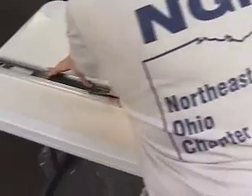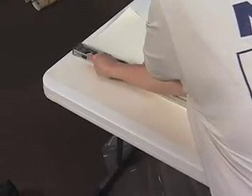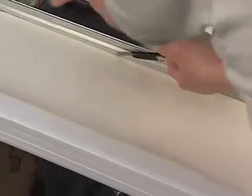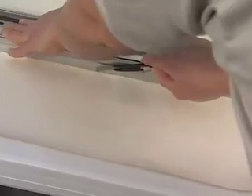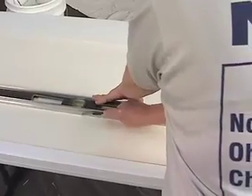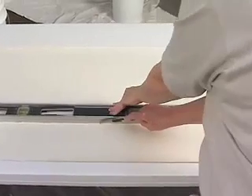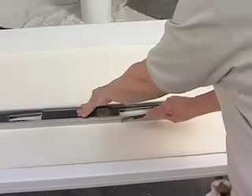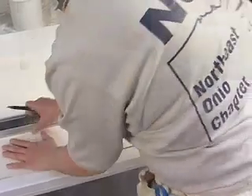Hold the level with your off hand. With a single edge razor or snap knife, press the blade against the level and cut the paper, running the blade along the edge of the level. If using a razor blade, hold it between your thumb and forefinger. Move your hand to hold the next spot down before you slide the blade along. Cut slowly and carefully. Don't use excessive pressure, and always use a new blade.